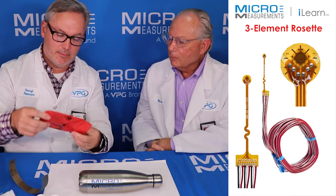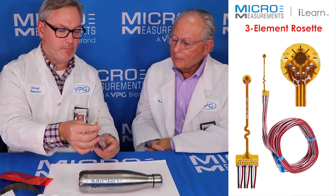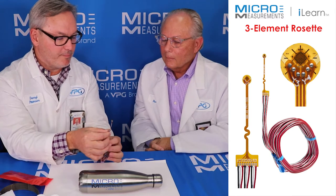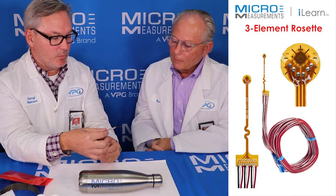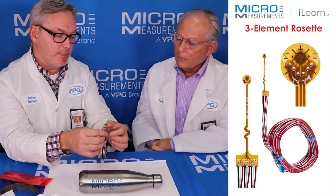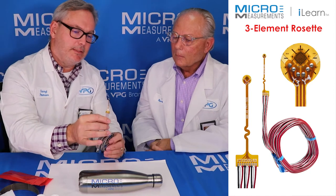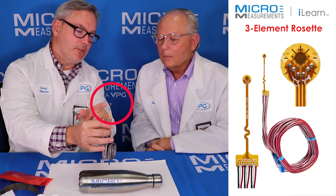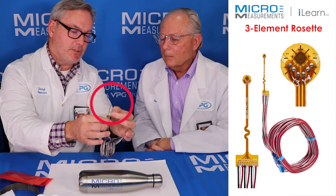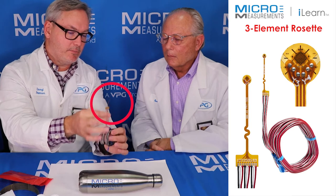It's one of our newest products — a relatively little tiny strain gauge, and then all of this wire. What we're finding today more and more is that customers want to speed up the installation process. One of the ways we can help is by supplying the gauge with the cables already pre-attached. This is actually a three-element rosette, so it's got three sensitive grids, connected via a new flex circuit design that ties back to a three-conductor lead wire.